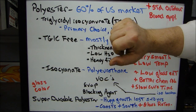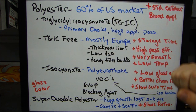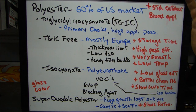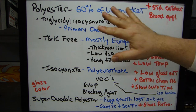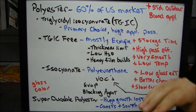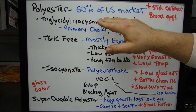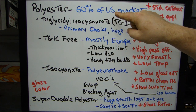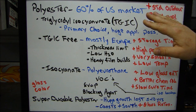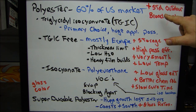When we start talking about resins and chemical compositions of powders for powder coating, first we talk about polyester — polyester powder coating. Polyester resins are for the most part the workhorses of the U.S. market, because more than 60% of the market uses these polyester-based coatings. They hold up very well to standard outdoor exposure.